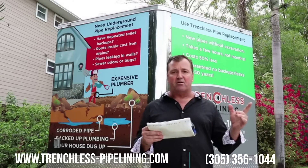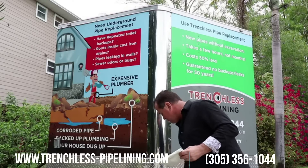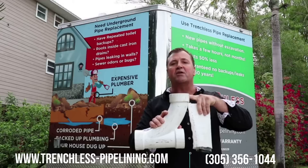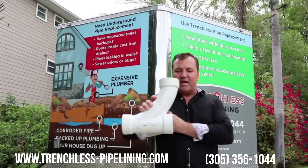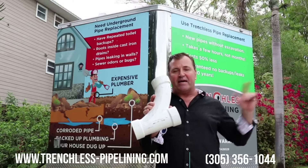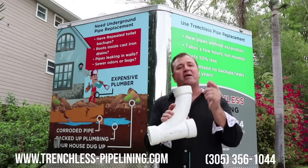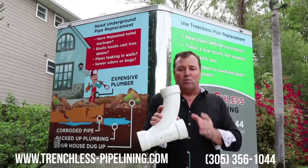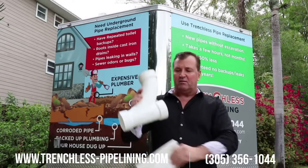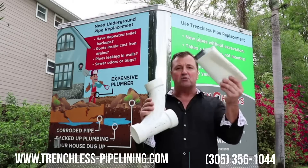After curing for four hours in the pipe, this plastic layer allows us to pull everything out and leave behind your relined pipe. We put the video camera from outside into the pipe we're going to reline. When it reaches the center section, we mark the cable outside where the pipe emerges from the house. We push the camera to the next intersection, make another mark, then pull the camera out and lay it next to the lining. Wherever there was a mark representing a connection, we cut out a piece of the lining before installing it.